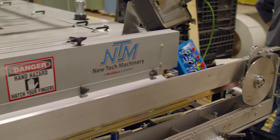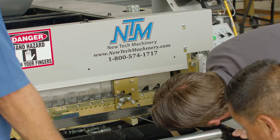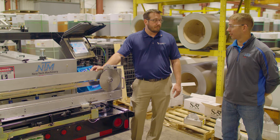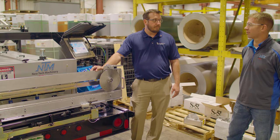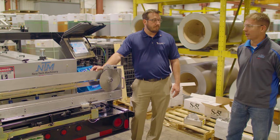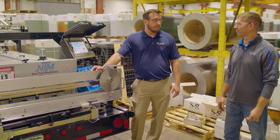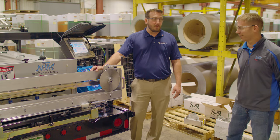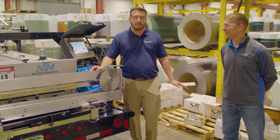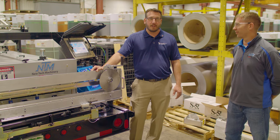Another big one is the guillotine. The shear is a hydraulically powered shear on this piece of equipment, and on a lot of other roll formers out there — it's a very dangerous end of the machine. Hands, clothing, anything that is important to you, you want to keep away from that shear blade. It doesn't care what's inside of it — it's going down one way or the other.